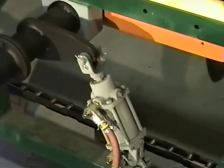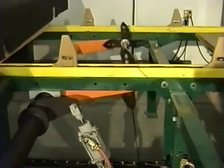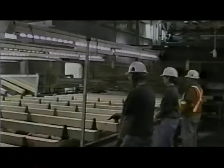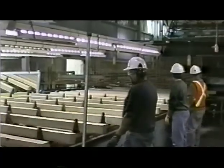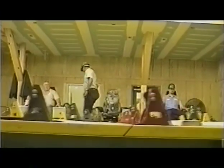The other adjustment is the pop-up timing. Here is a typical pop-up assembly. This system allows for multiple graders. If you use three graders, the pop-up system is set to turn every third board for each grader. If you use four graders, every fourth board is turned. You can set this up so you can use three graders one day and two the next by locking one station down.